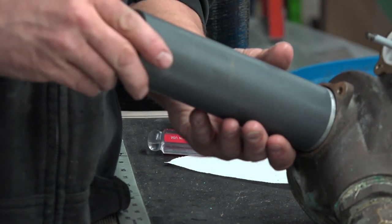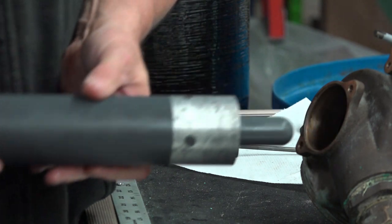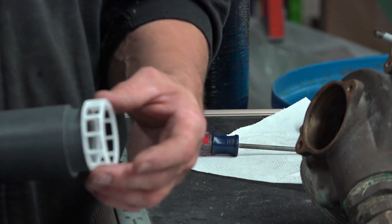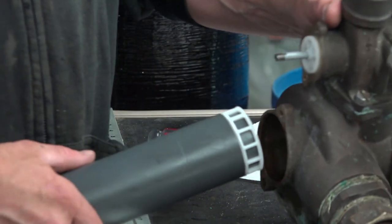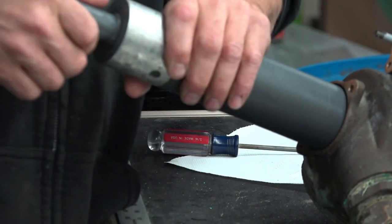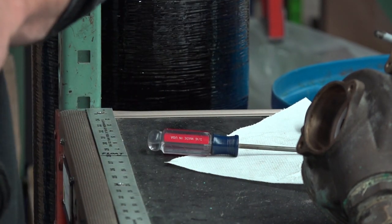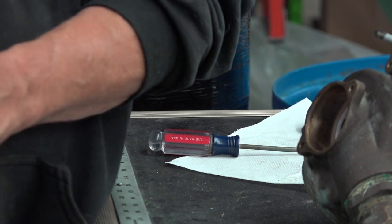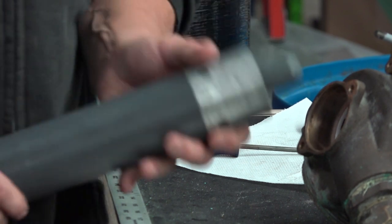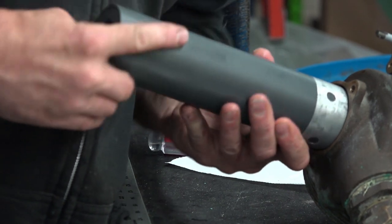And be careful with these tools. On the end where you see that stainless end that Bob was working that O-ring in, if you're careless with the tools and you drop them, mm-hmm. A lot of people throw these in the bottom of their toolbox. Treat them with care. They're expensive tools. And if you get that out of round at all, you really lose the value of having the tool. You're able to get it in, but you're not getting the even pressure that you once were. So making sure that you keep that in round, don't beat on it or drop it or let it roll around in the bottom of the toolbox. $500 a pop, you don't want to be mistreating these.